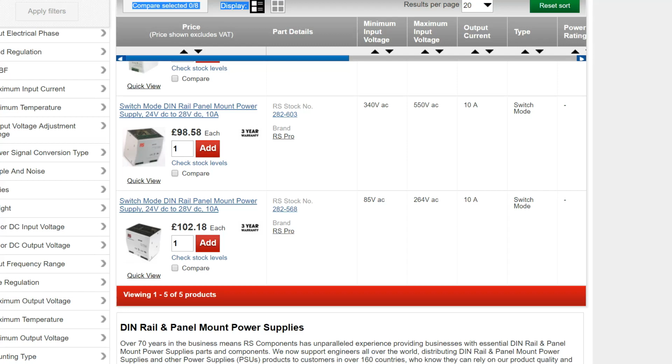What is really interesting about this power supply and what sets it apart from pretty much any other one that I have seen so far is this extended signaling capability, the configurable parameters of how it operates, the ability to lock out the front panel from tampering and things like that. It makes for a very flexible but pretty secure power supply that you could integrate into one of your control systems, whether it be motion control, security, whatever else it may be. So I like what I see, and I'm going to be putting this into one of my solutions.